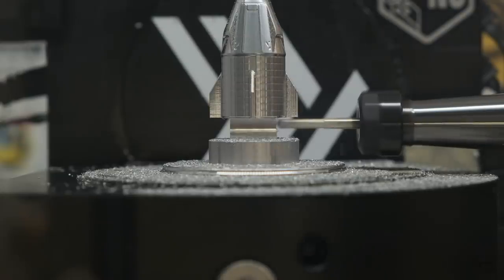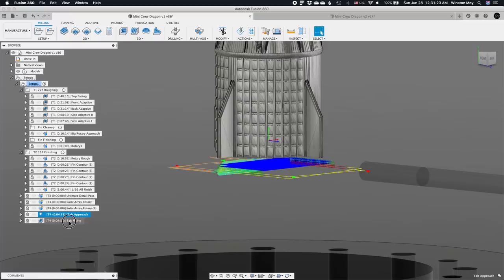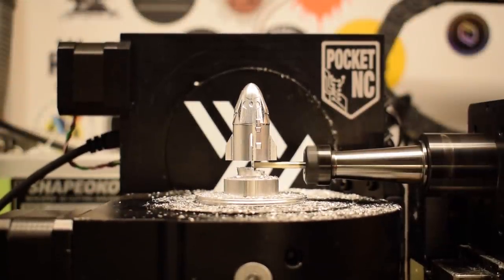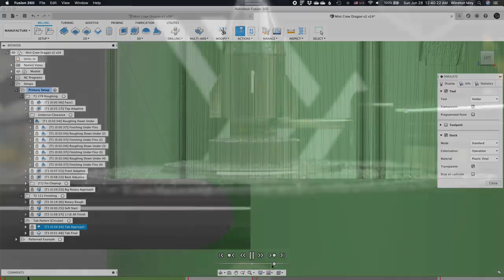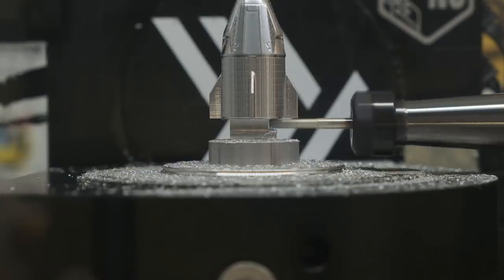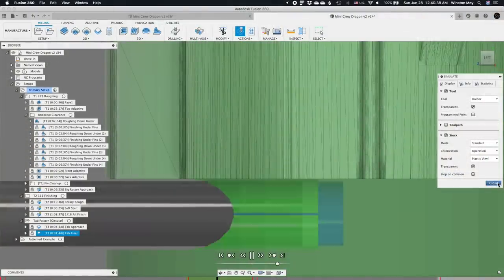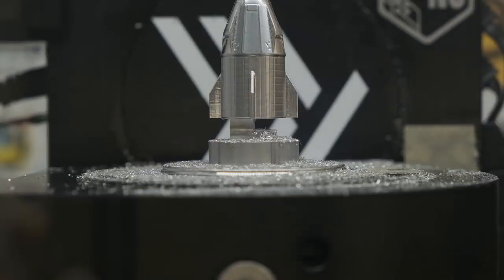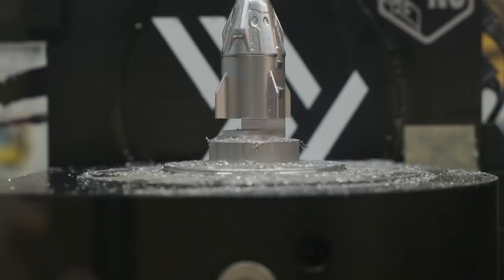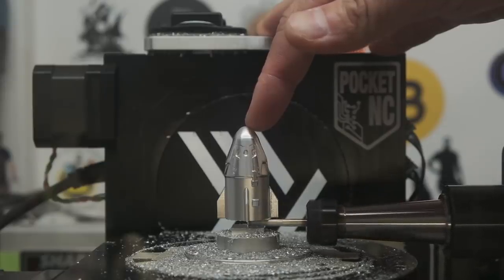For my operations to tab off the capsule, my new method was to use strictly 2D contours. Previously I did a 2D contour on one side while the part was still rigidly attached, then used a constrained adaptive to nibble away at the rest, thinking that would reduce vibration and prevent the end mill from biting the bottom of my capsule. The new method uses a 2D contour toolpath with a finishing pass to within 3 to 4 millimeters of the centerline, leaving a smoother finish at the outside of the capsule's bottom and reducing wall contact on the end mill. Then I switch to a single-pass contour with some stock to leave, so any small vibrations remain proud of the final geometry and I can sand things flat later. This toolpath was patterned 180 degrees around my part, took about 10 minutes, and I only had to pay attention to the final minute or two. The cumulative effect of all these changes was a net reduction in theoretical machining time of about an hour, with vastly improved part consistency.